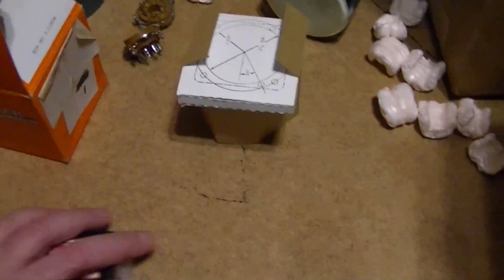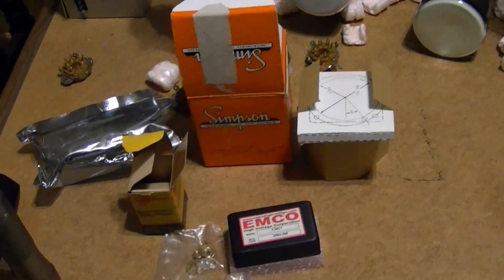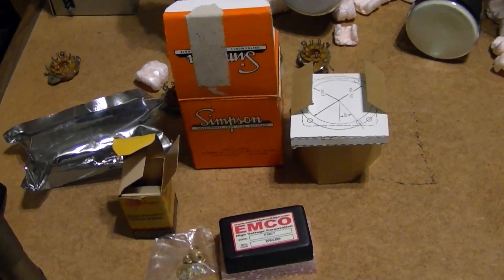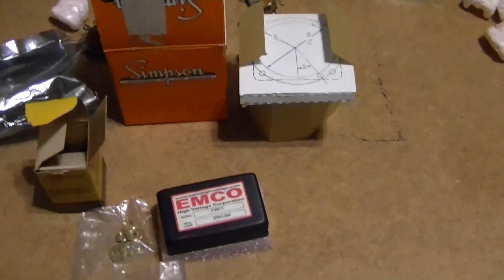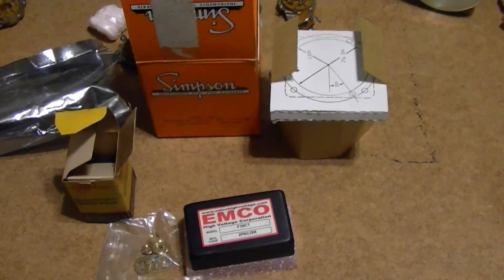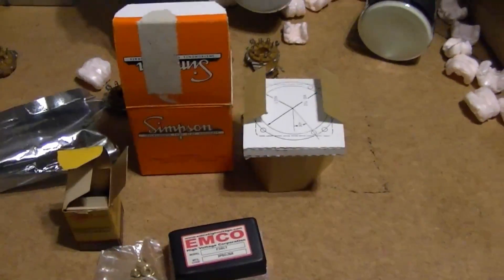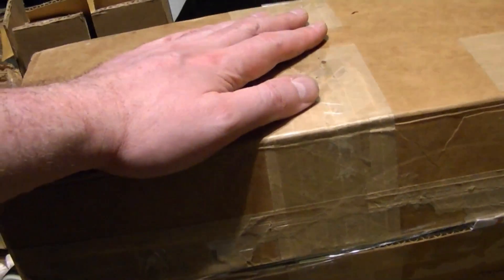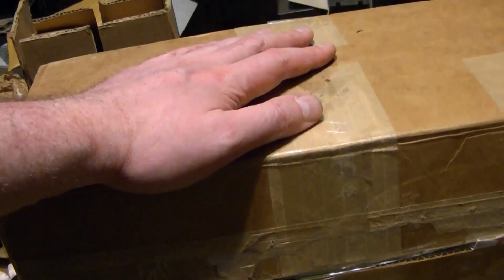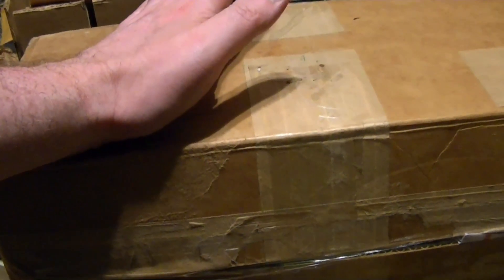And then of course I can hook it up to the CRTs. I'll just need a few more bits and pieces, mainly an enclosure, and I should probably get some kind of special binding posts — or at least one that can handle the high voltage. I can't just use a plain old banana jack with 3,000 volts on it unless I use something like a Bakelite enclosure. The other reason I mention Tuber is that he sent me this package — we talked a while back about something I needed, but I'm not exactly sure what he put in here. He didn't tell me he was sending this and it just showed up today.